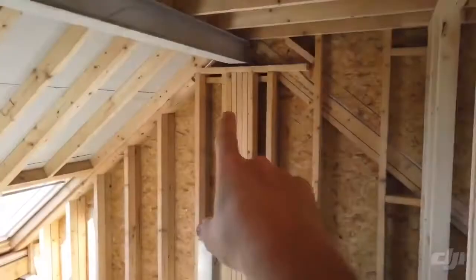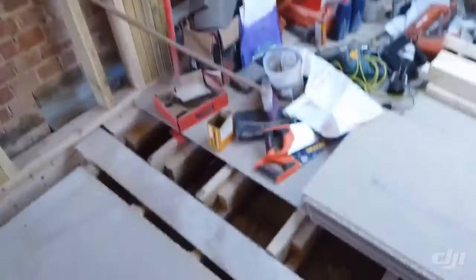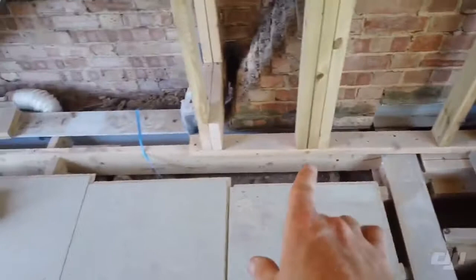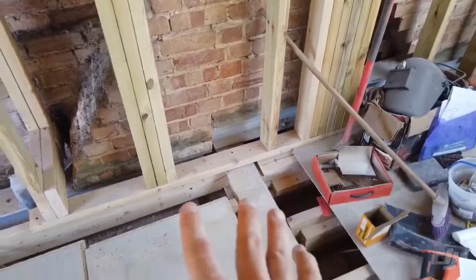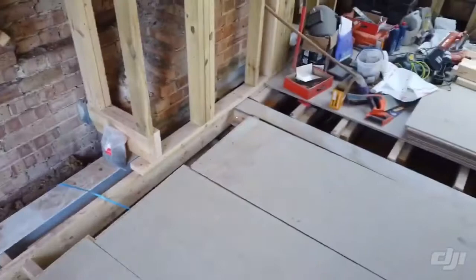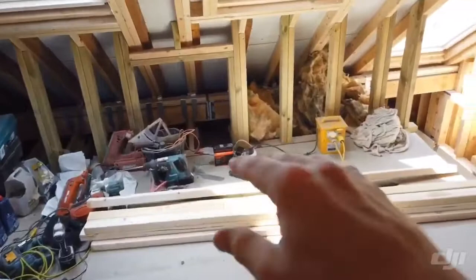On this one we've got three steel beams. Here we've got the ridge beam — we've got a timber gable over there with a post bearing plate, and this end we've got exactly the same post bearing plate. Then in the floor, because we couldn't determine whether the central wall is load bearing, we've got a beam spanning the space down below. We've also got two extra beams in for the chimney — the client at a later date is going to take the chimney out in the bedroom and kitchen below. We've put the steel in at the top now to enable them to take the chimneys out later without any knock-on effects. Then we've got a small eaves beam out the front taking the floor and the dwarf wall.